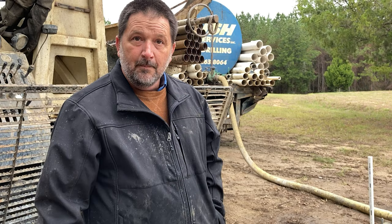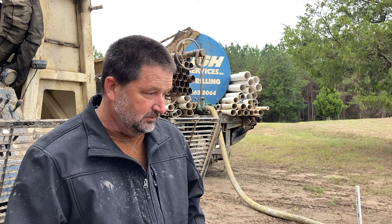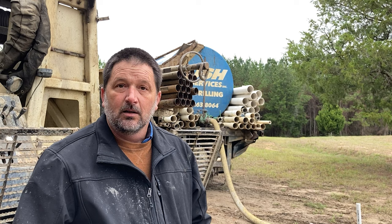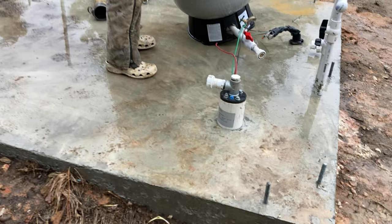When you say you blew air to put sand around the screen, that won't fill in the screen? No, sir. What we do is we blow air down into the well and it brings the water out. And as the water's coming in, it'll bring that sediment — sand, whatever you want to call it — back into that borehole and it'll pack around that screen. So we're at 160 with the pump, and we're 240 foot on the well. We've got 180 foot of casing — we're 80 feet below the bottom of the pump now for clear well, with 60 foot of screen. And we never hit hard limestone rock — it was soft limestone. All right, let's get this thing back together and run it.